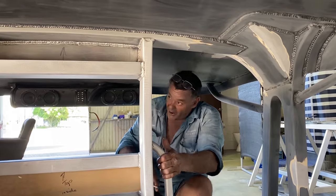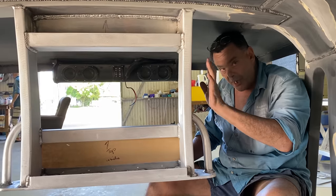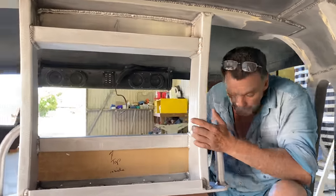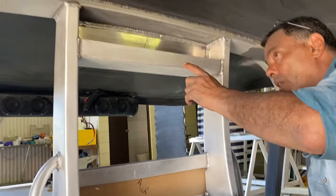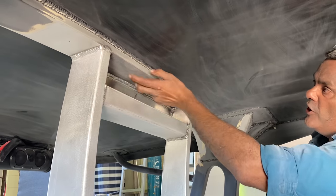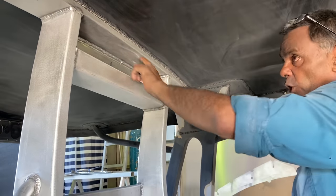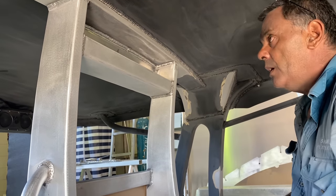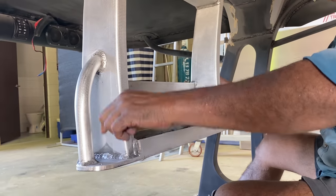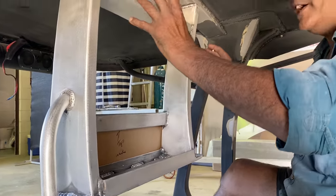But we've eliminated it. We told you guys the other day, we fabricated pillars and put a little partial shelf there. We've tied it all into the top of that stiffener that we originally put in the roof. That's a 6mm bit of box cut down, so that's fully welded to the roof. The 10mm plate goes onto the 10mm plate we've put on the console. It's all been drilled and tapped. That'll get screwed down, so it's going to support some of the weight.